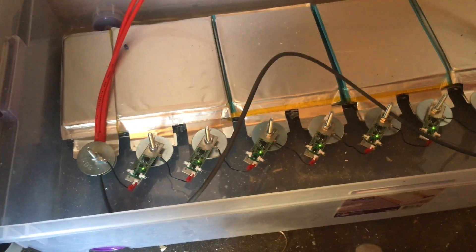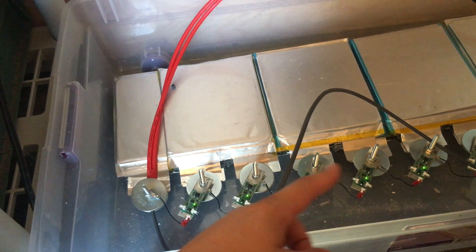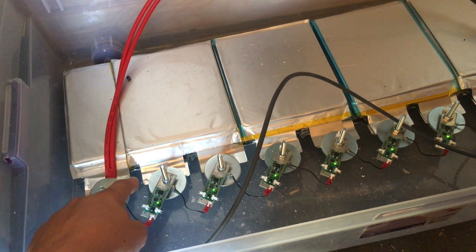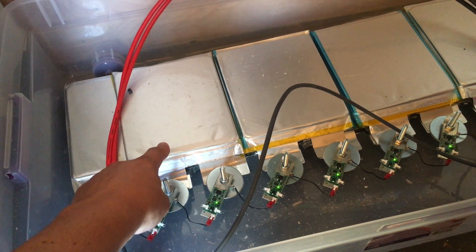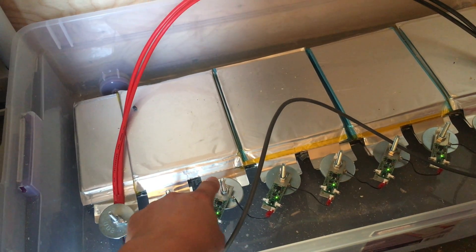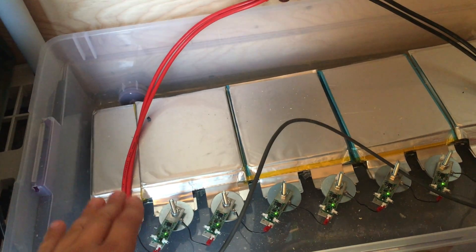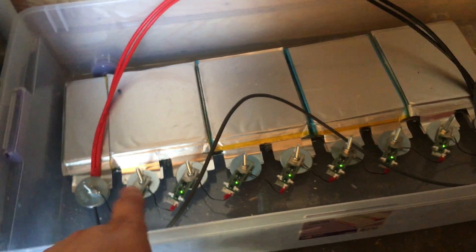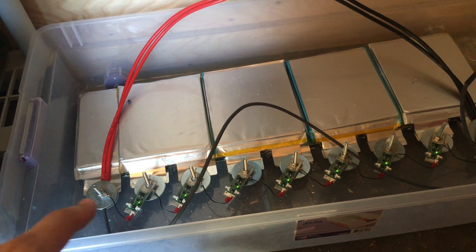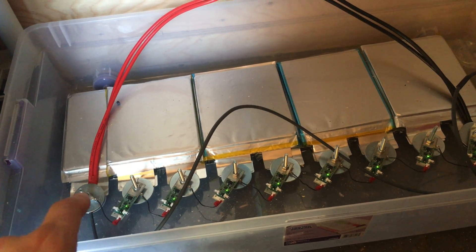This is how I'm doing these things now. It's a bit wide, but you've got a single battery here, one underneath it, and then a battery on top. They're arranged one-two, one-two, one-two, one-two — so this configuration is eight cells long by two in parallel, which makes it eight series, two parallel (8S2P).